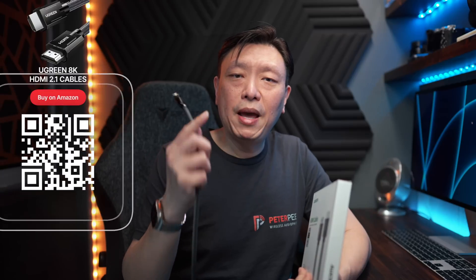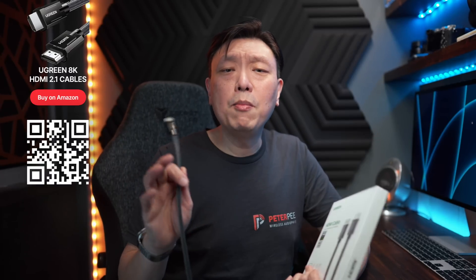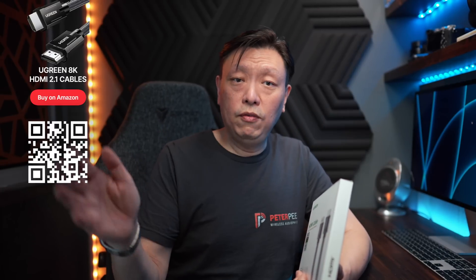To ensure the best experience with this device, I recommend using the highest quality HDMI cables available — highest quality, not highest price. I don't believe in spending unnecessarily on expensive cables, as they are not going to enhance your sound or picture quality no matter what manufacturers say. I've tested and used Ugreen 8K HDMI 2.1 cables, and I'll be leaving affiliate links in the video description below. They are by far the best value cables for your setup. If your current cables are serving you well and are certified HDMI 2.0, there's no need to change them — but if you're buying new cables anyway, do check these out, as they'll minimize connectivity issues and ensure enough bandwidth for the highest quality image and sound.